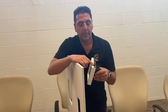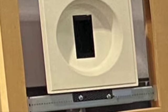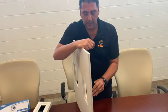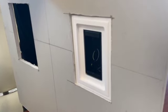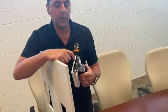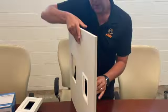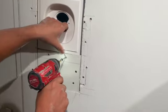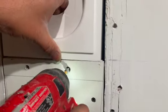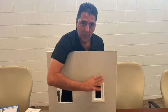We've seen instances where if you're using bigger, bulkier head screws that are not flush or not pre-drilled into the aluminum, it would actually push our device further back — like that — which makes it more difficult to install. In that case, there are two things you can do: you can either adjust the brackets in the newer model to the three-quarter setting to bring it flush, or you can screw through the front of the drywall into the bracket, just like when mudding standard drywall. The screw gets flush, and when you're mudding over it you're hiding the screw surface.